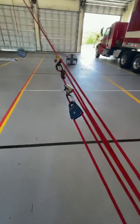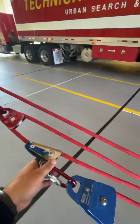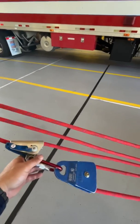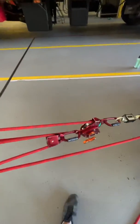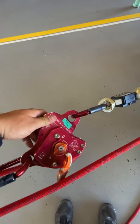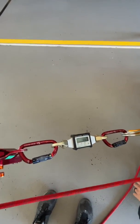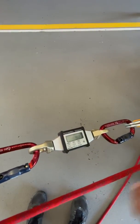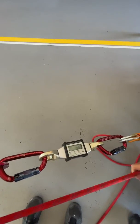With our nine-to-one compound system, we still have 100 pounds of load divided by the ratio. So 100 divided by nine gives us 11.11 — we'll say around 11 to 12. With 2T on our becket and 6T on our MPD, that's 8T total, so we should have around 88 pounds on our enforcer. We know there's efficiency loss in the pulleys adding a little weight, so we expect to be in the 90s somewhere. We go ahead and haul — and we're at 96, 98 — so we'll call it 98 pounds.